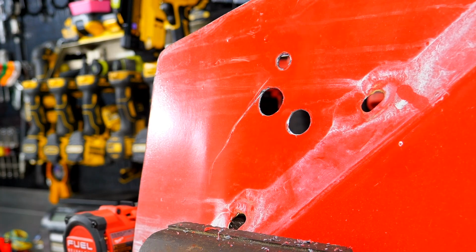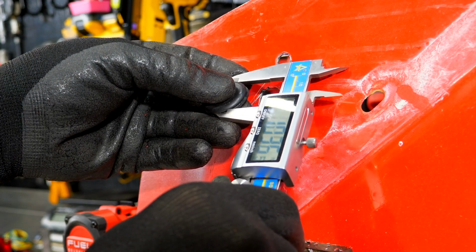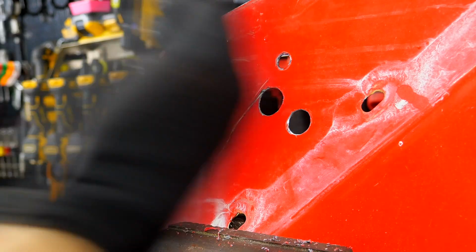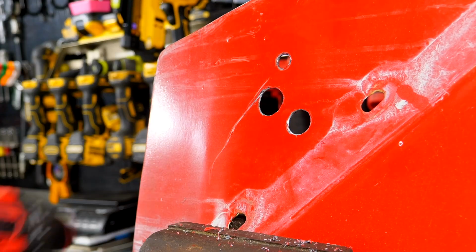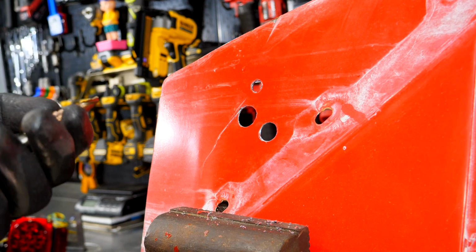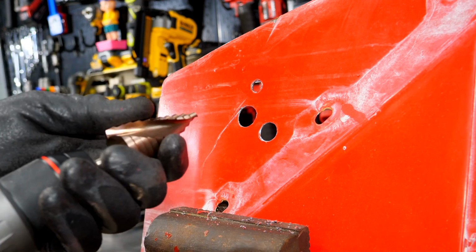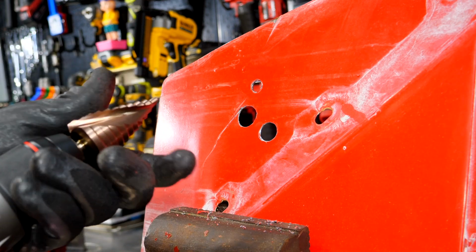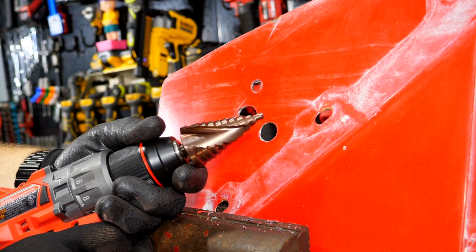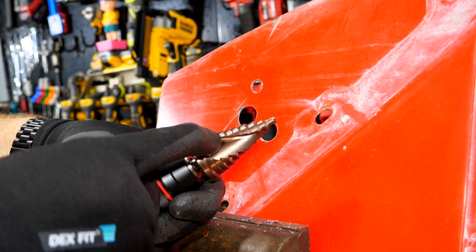Now, the reason is I have a grommet right here. And let's measure the inside of that grommet. Looks like a 1-inch grommet. So let's say we're running wiring through a firewall, something like that. And then let me give you a little tip here. I'm going to go to my biggest one. So here on this biggest drill bit, our 1-inch is right here, this step right here.